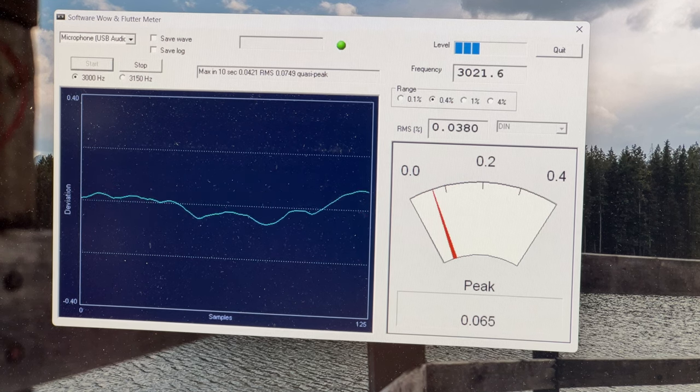So my next step on this deck will probably be mostly off camera. This board is getting recapped. This is the auto calibration computer board. There aren't many electrolytics on this board, but what I really want to do is recap this board separate and see if the auto cal still works on all three tape types. And if it does, then I will continue on to recapping the rest of it. But I got to show you how to deal with a circuit glue first. So I'm going to do that.